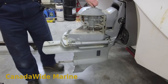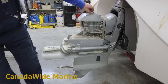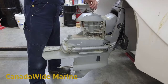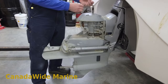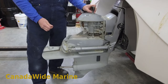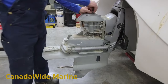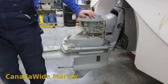This is the dipstick for the oil level that I'm taking out. I have a lifting ring that I fabricated that screws into that hole. I'll check the gear lube level while I'm in there. This is springtime - April right now. In the fall I changed the gear lube when I winterized this boat. You want to make sure there's no water in the gear lube - don't want it sitting in there all winter. If you just do a once-a-year service, you'd want to be changing your gear lube right now as well.